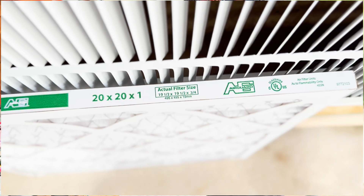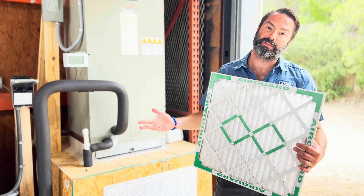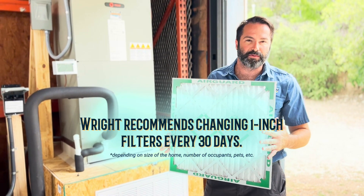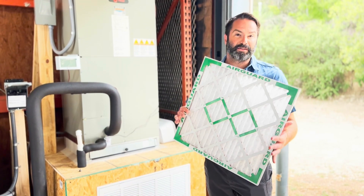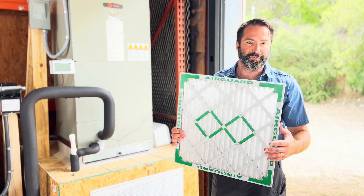The downfall of the one-inch filter is that because it's only one inch, it doesn't have quite as much surface area as a two-inch filter or a media filter. These tend to be considered more of a 30-day filter — you don't get as much lifespan out of them. They are still convenient and get the job done, but you have to tend to them more frequently.